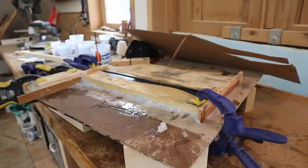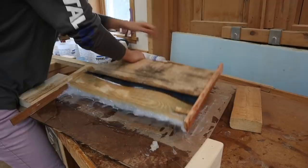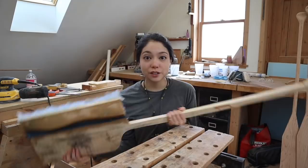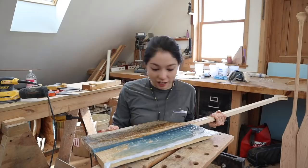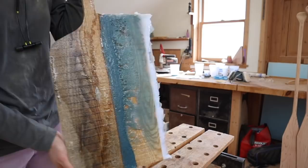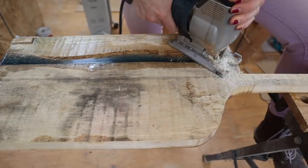Once it was cured, it was just a matter of pulling it off of its mold. I did have a lot of issues with the epoxy leaking out and gluing scrap wood to it, but nothing a hammer can't fix. This turned out disgusting, but it's workable. The silicone had gone bad and it never set — it was supposed to set in 30 minutes and just never did. I think that's part of why it leaked, and it looks like it reacted with the epoxy, so it's got the consistency of a sponge. I decided to procrastinate on cleaning it up and jigsawed a rough outline so there would be less to clean up.